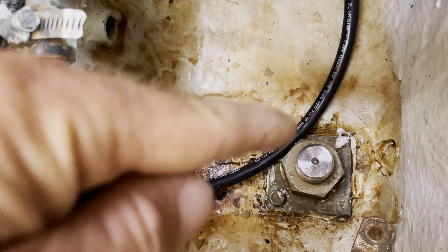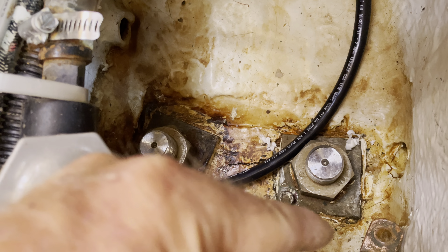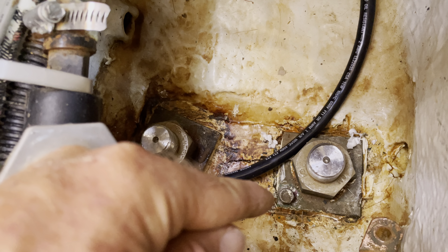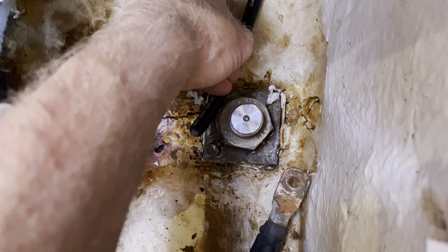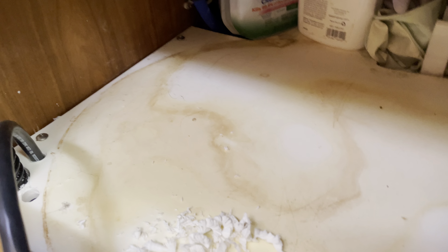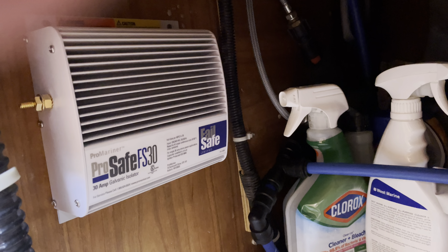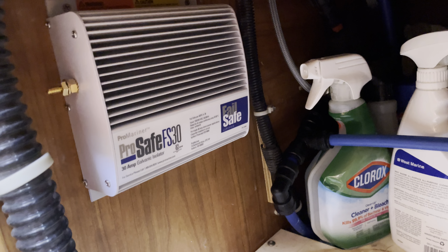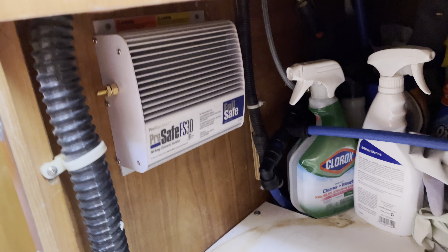What I'll probably do is wind some smaller-gauge wire with the jacket taken off around the bolt itself a number of times, maybe in a big figure eight with the smaller bolt there, as I tighten it down. The connection will be coming from here this time. If you ask where does that go — it goes up into this cabinet where I have a galvanic isolator.